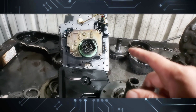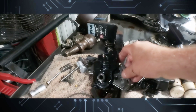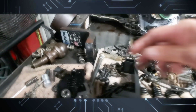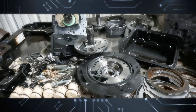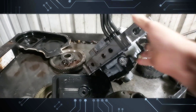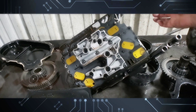On this one, nothing has come out yet — I haven't seen valve body warrants on this yet and I never had that issue. Range sensors are an issue though, so we're going to put a new range sensor on it. It randomly sets a range sensor code — they're pretty simple, it's just four fingers right there and it's a digital sensor. There might be something wrong inside the connections, but it's just fingers touching the rail. They do fail. Solenoid packs also fail and they're not easy to replace on the vehicle, so you might as well just put a solenoid pack on it.